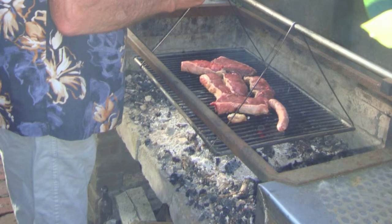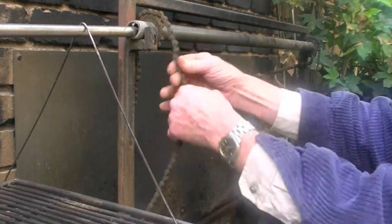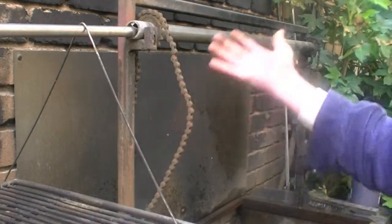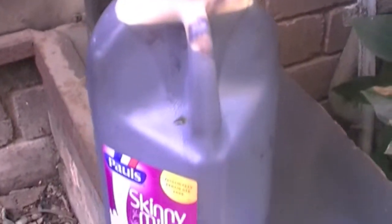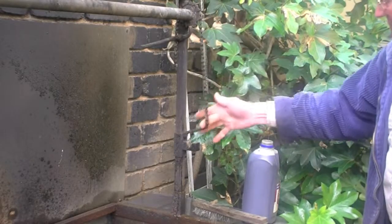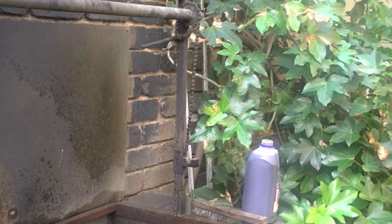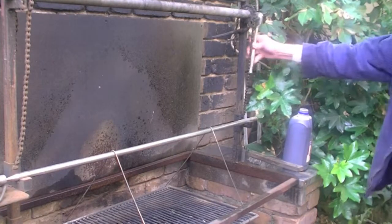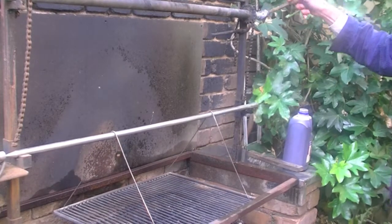Well, I didn't invent anything there, did I. Anyway, the problem I have with this raising and lowering setup is every winter the chain seems to rust up because it doesn't get much use. The first time I use it I spend about an hour cleaning it up so I can get it to interact with the sprocket. So I said I'll give this molasses a go with this chain. Look at this - a week later the molasses has penetrated in between the links of the bush roller chain, it's only a bike chain really, but it's penetrated in there and you can see it's swinging around free and limp. It's really done the job.